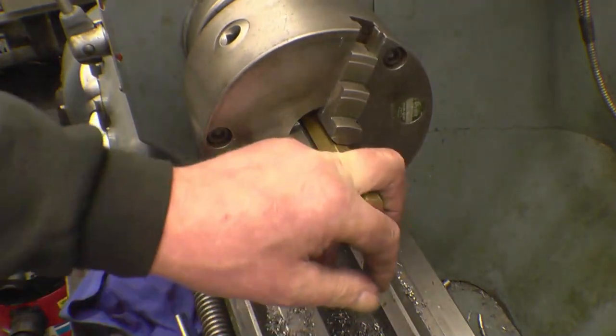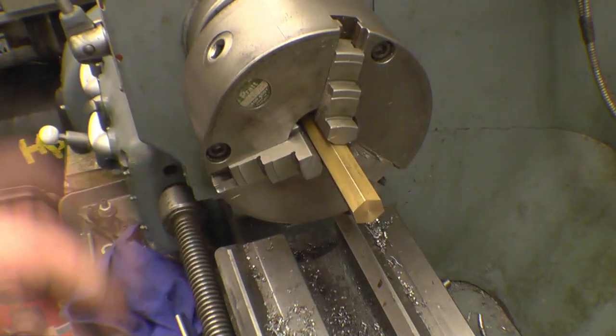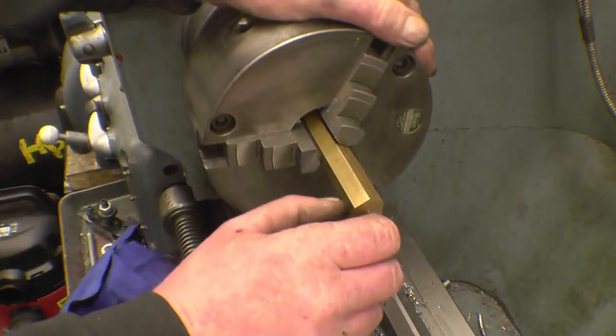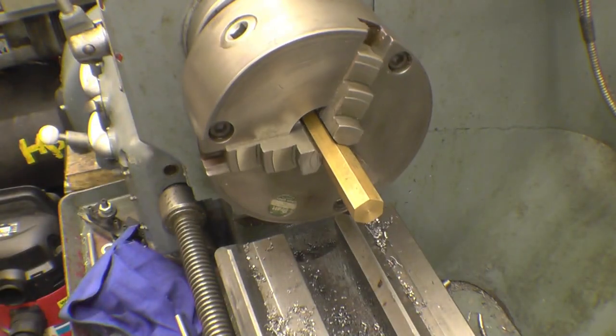Okay, so we'll centre drill this. Put the 7.9mm drill through it, put some threads in, then we'll part them off and chamfer them as we need them. You want them to be 1/2 inch thick, so they're going to be big chunky nuts, obviously for a specific job.